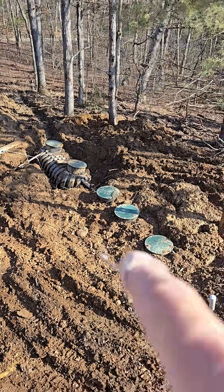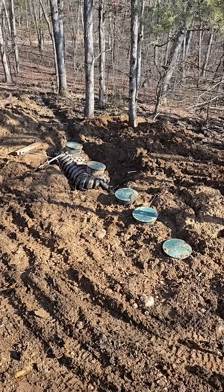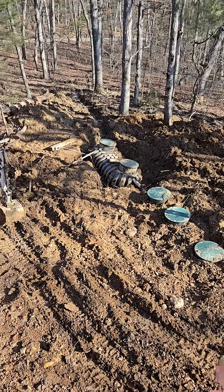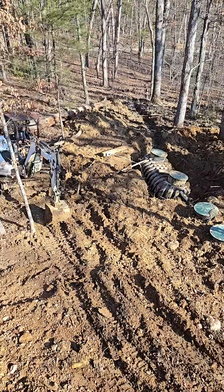What we do is fill the tank full of water to anchor it down. But see right here — this tank did not get any water in it. It literally floated up out of the ground, and it ripped all the connections and plumbing all up.